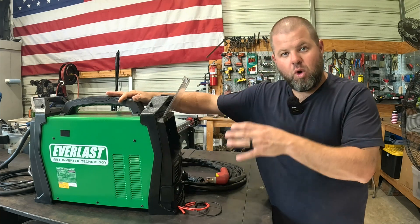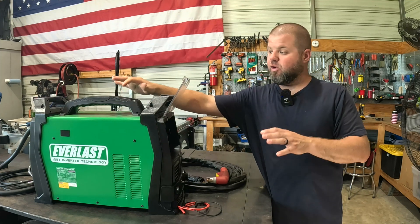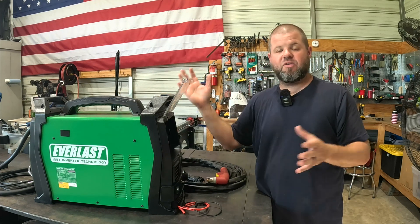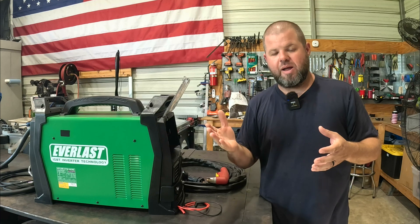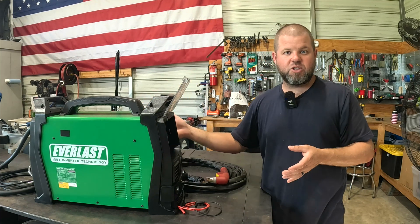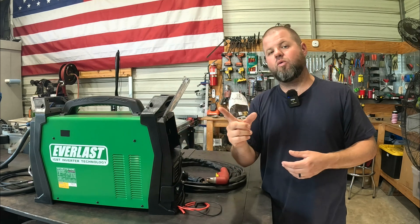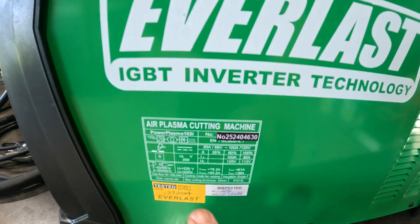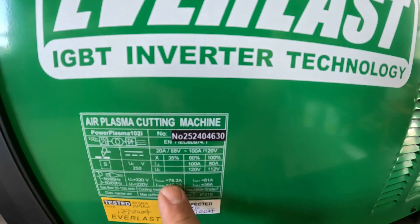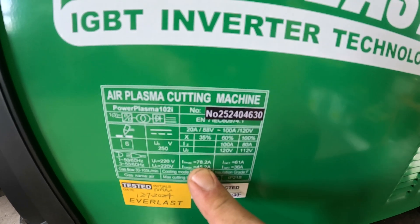This particular unit is one phase or three phase — 240 volts or 480. If you want to run it up to the max, I recommend wiring it straight to a disconnect. If you're going to run lower amperages, which will still cut extremely thick material, I just wired it into a four gauge extension cord in the shop. The 60 and 80 amp machines are single phase, 240 volts only. Something else to note with a machine this size: maximum inrush current is 78 amps, so you'd want to hardwire and probably go to three phase.